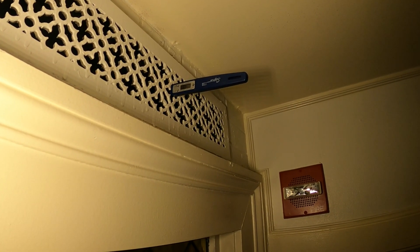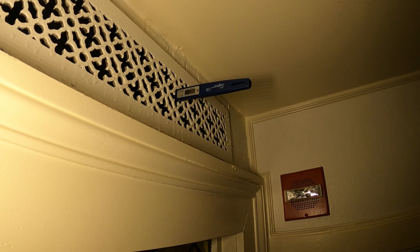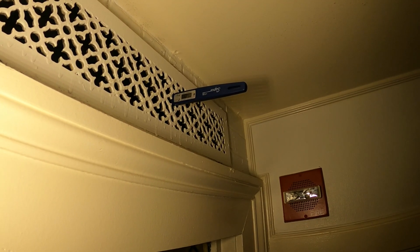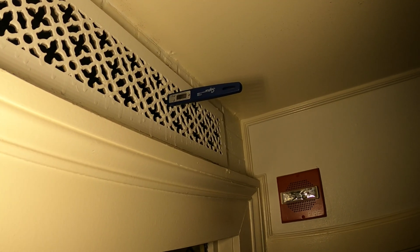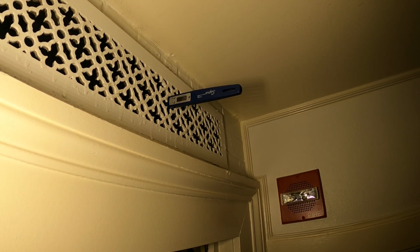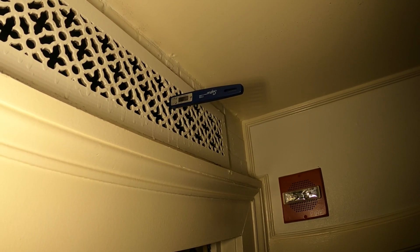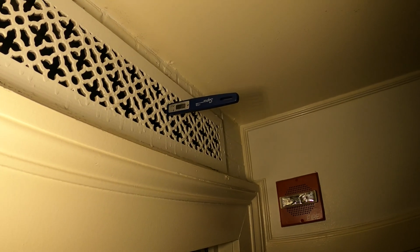Let's go check temperatures again. And won't you look at that — 54 degrees, 53.6. Why would they close that? Unbelievable, but that just goes to show you how important it is to do a thorough job. The unit is working as it should. The actuator is opening and closing as it should in cooling. The auto changeover switches are doing their thing when set to heating — it senses a cold pipe and redirects voltage to energize the heat relay, and we saw eight amps on each line on both heaters. Should be good to go.